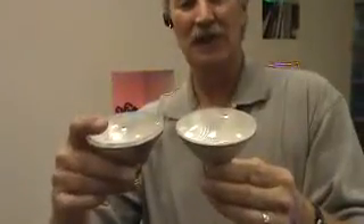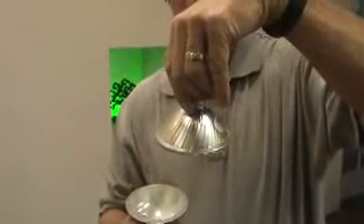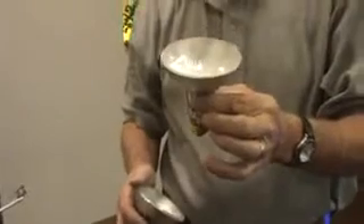I'll compare this to another PAR30. They call this one the short neck and this one the long neck. The whole reason for that is you have different installations where you want the lamp to be flush with the end of the trim looking from down underneath — you don't want the lamp way up inside the fixture so that you have gaps around inside. That's where the long neck comes in. I will demonstrate that for you in just a minute.